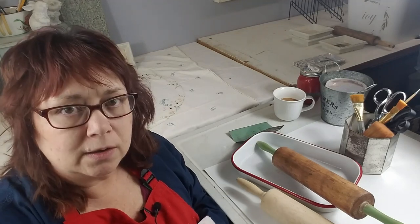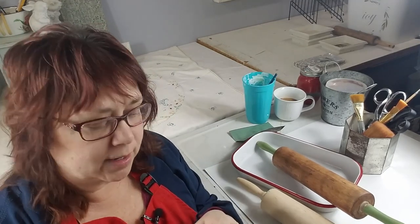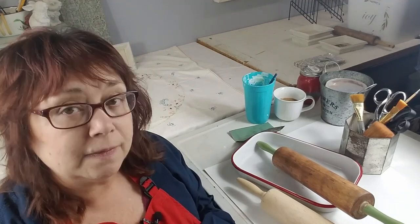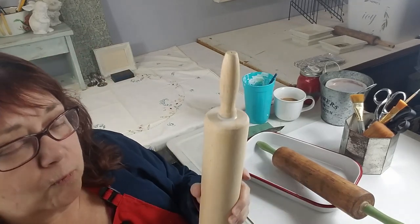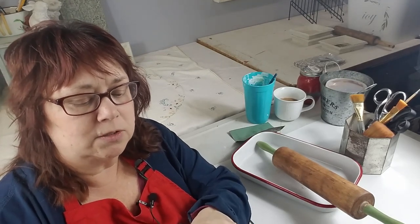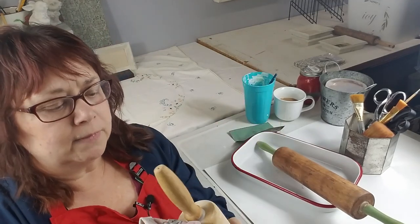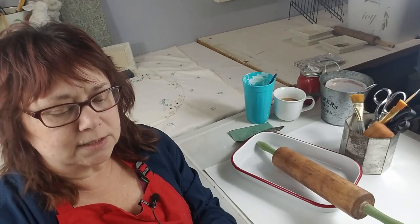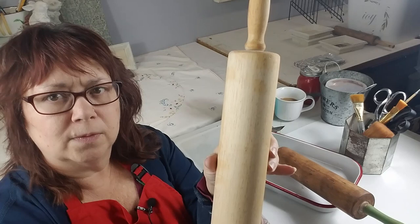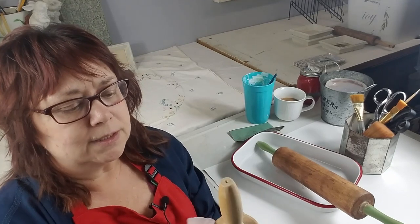After wiping off the dust, get it wet and wipe it down again. It's okay if it's wet because we're going to add a water-based stain. The water will actually open up the wood and help that stain penetrate. Wiping it down wet is also a good opportunity to check if you've missed any places — if you put water on an area and it doesn't get darker, you know you've missed a spot in your sanding and you can go back before the stain stage.